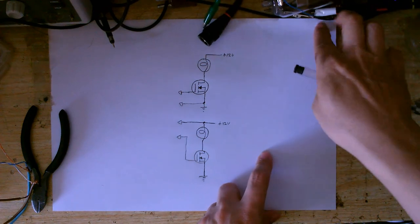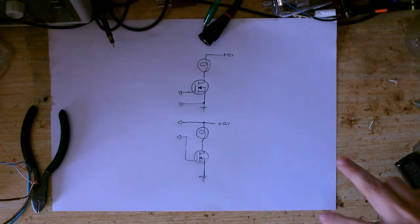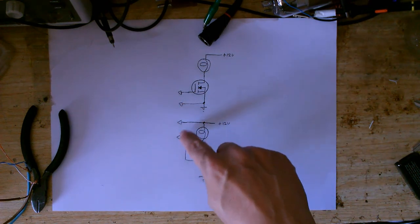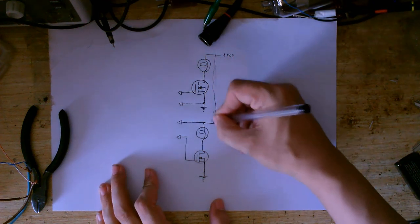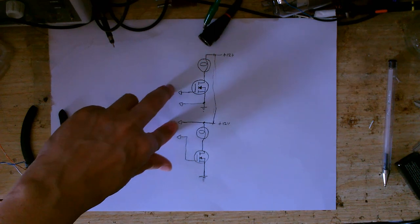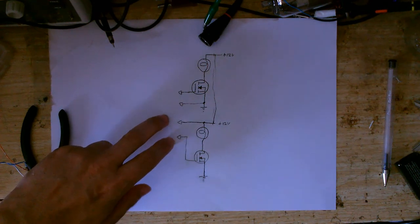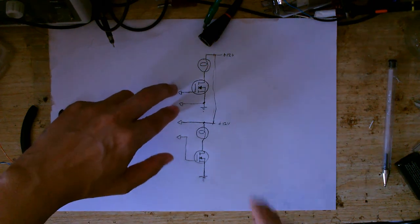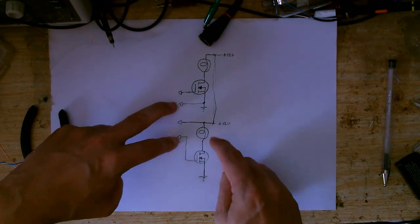This is the little old circuit. As you can see, two light bulbs here, two MOSFETs here, and open connections to the gates — positive and ground. These two 12-volt rails are the same, so you can just think of them as connected together. So if I touch the 12 volts and the gate of this MOSFET, this light will come on. If I touch the 12 volts and the gate of this MOSFET, this bulb should come on. If I touch the ground and the gate of this MOSFET, this light should go out, and same for the other MOSFET.